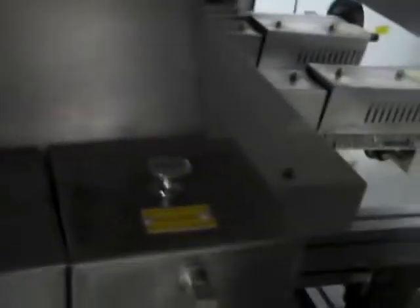Each of these doors is functioning and does work. Here's a view from the back of the machine. Here is the access to the fluxer pot. There's one pot for flux and one for alcohol for cleaning. When we use the machine, we'll clean it with alcohol and food coloring so we know the alcohol has made it through and the flux has been removed. This has worked for us well.